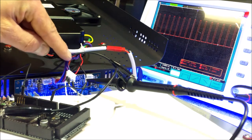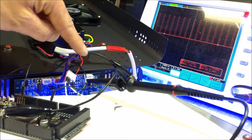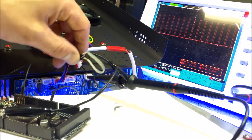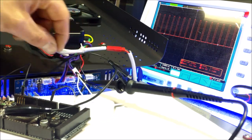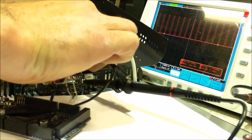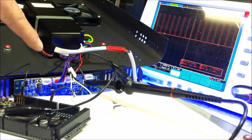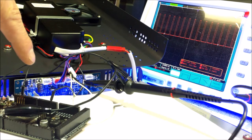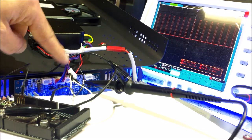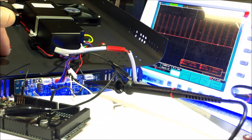Based on the way it looks, it'll be super simple to drive it. On this connector you have on/off, 12 volts, PWM, and ground. What happens is when you take 12 volts and jump it across — as you can see I did here from blue to violet — that turns the channel on. If I unplug this wire you'll see it'll turn that channel off. So to make this work I can use a digital pin on the Arduino to basically transfer 12 volts from one pin to the other, and that turns the channel on. By default it starts out at one percent.